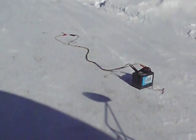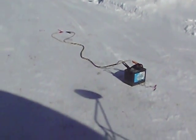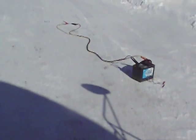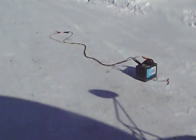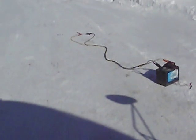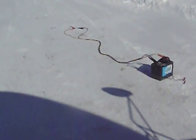Those little valves, they do pop. I've experienced some cells reading zero volts and that was because the little vent had popped, basically shutting the battery down. Now it doesn't necessarily always mean zero volts at the terminals means there's still voltage within the battery — the battery itself could just be drained. They also recommend that once it's been fully discharged for an extended period, the copper inside starts to degrade, and they don't recommend charging it back up after that point. That's one reason why lithium batteries in storage should be stored at about 40% charge.